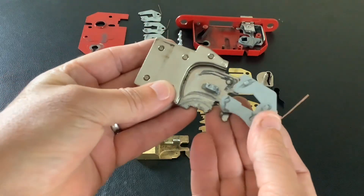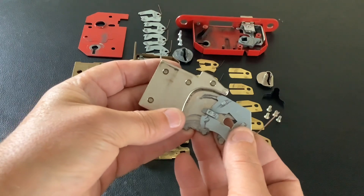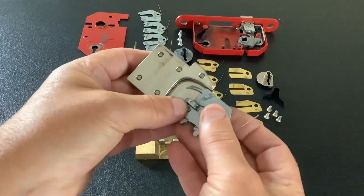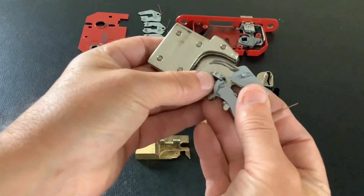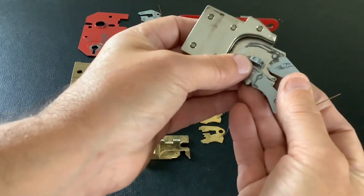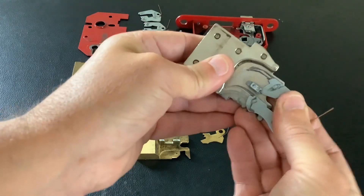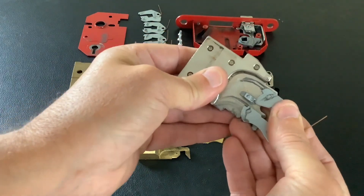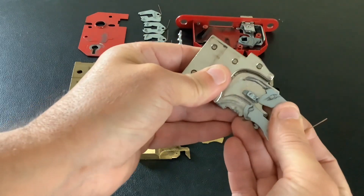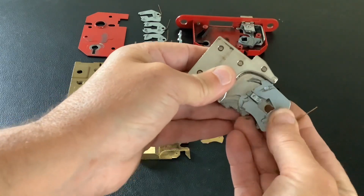When you're picking the levers up, the aim is to get the bolt to go through the true gate. When you pick all five levers up, the bolt slides through all five levers and gets you the open. The levers can slip into anti-pick notches or false gates — that little nick there will get caught in that groove on the bolt. Once it gets caught, it's jammed; you can't lift the lever up anymore, so you can't get the lock open. You want to lift past that anti-pick notch and go through the true gate to get the lock open.